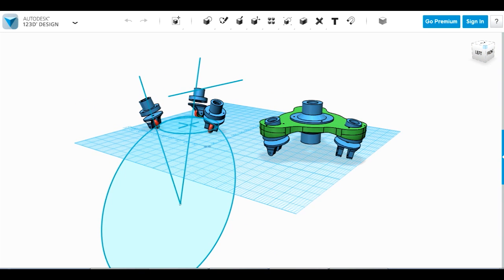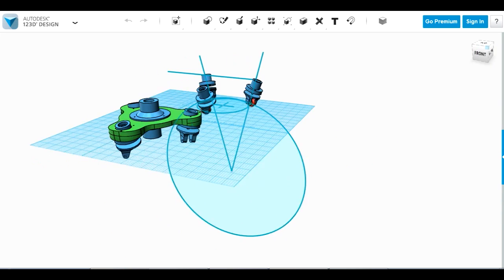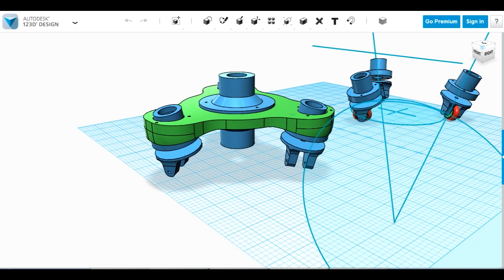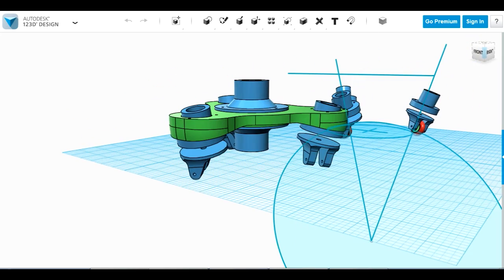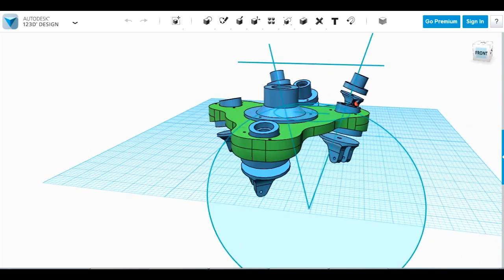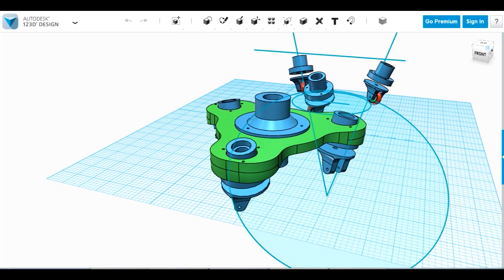Now there's another part to this. As casters reverse direction, obviously the wheel has to swivel all the way round the other way, which causes some sideways loading and makes the thing move slightly around in that circular direction as the caster rotates, and there are 3 on here. Plus they're on the surface of a round ball, and the head needs to move in all directions, so it needs to move sideways, backwards, forwards, and it also needs to rotate.